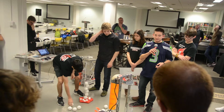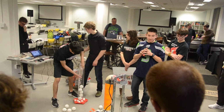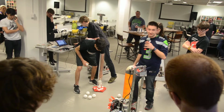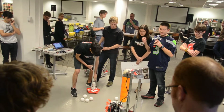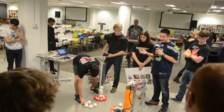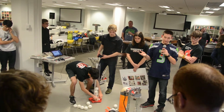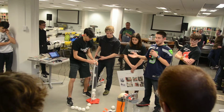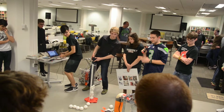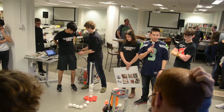Yeah. So we found that because the draw length is so short, the springs are right here, so it's only like 3 inches of springs. We found that we have to pull like 45 pounds of force to actually shoot it that high up. So we had a whole bunch of different troubles at first because it wasn't shooting as high. I think there's 4 springs in there that are very stiff, and you can probably shoot like 5 feet in the air if there wasn't that on it.